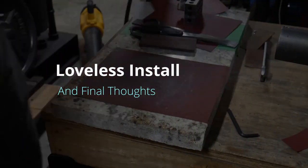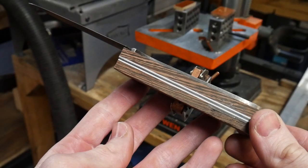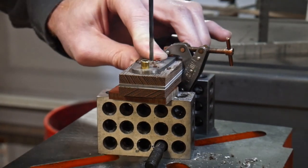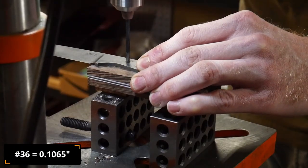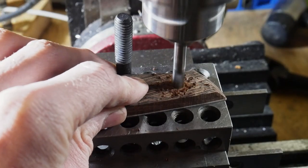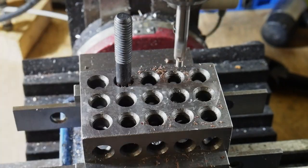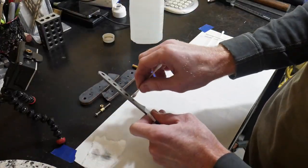The last portion of this video covers how to install these Loveless fasteners onto your knife. With every handle scale installation, all pieces need to be flat — you can see I was flattening these two handle scales on a piece of granite. I then clamped the two handle scales onto the knife so the knife can be used as a drill guide. We'll be drilling two number 28 holes for our Loveless fasteners. Once the excess material is removed and the front of the handle scales are finished, we head over to the mini mill to drill our counterbores. I like using the mini mill because I can set a depth stop and drill the same depth on all four holes — in this case around 3/16 of an inch deep.